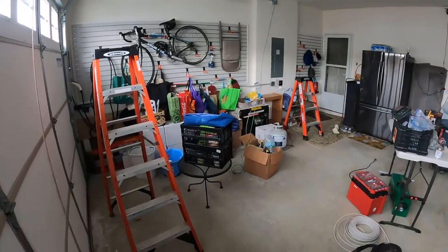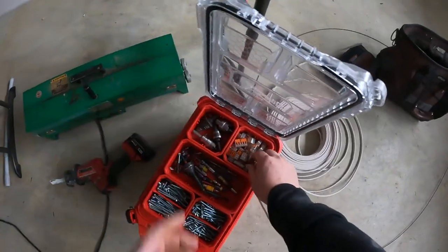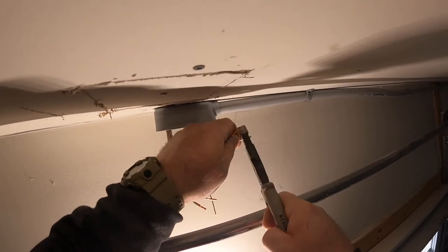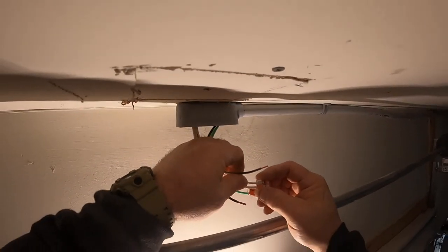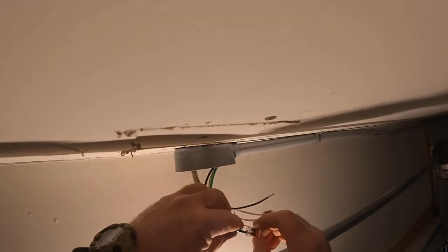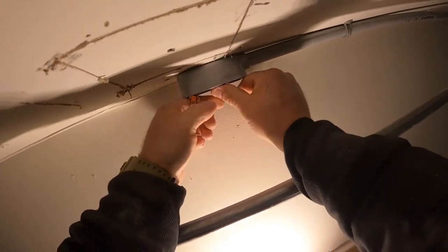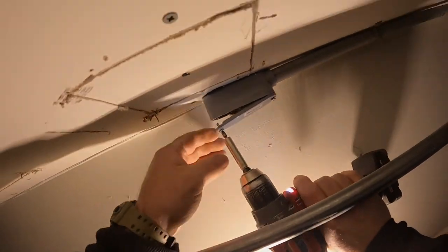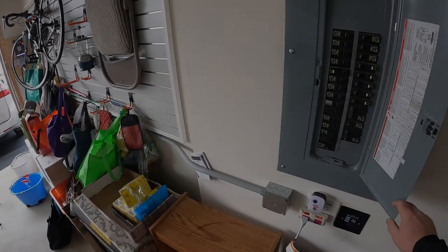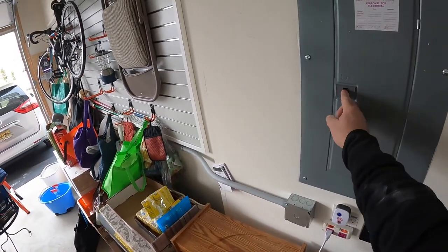I'm going to use Wagos — they're relatively new, a bit expensive, but easy to use and save labor time. You strip the wires back, open the Wago, clamp them down — quick and neat. Some might argue a splice isn't allowed in an LB, but as long as the LB has a cubic volume limit printed on it, you can do it — this would be the maximum number of wires allowed, you couldn't add more. Once we turn on the circuit breaker, we'll go upstairs and check the receptacle. She'll be ready to plug in that heater tonight. Thanks for watching.